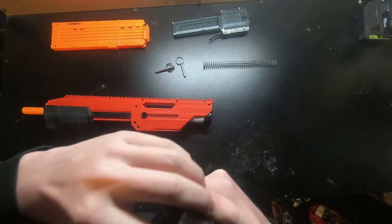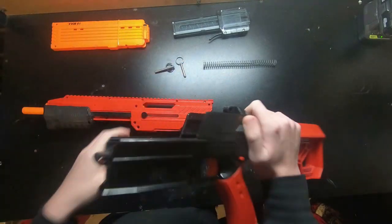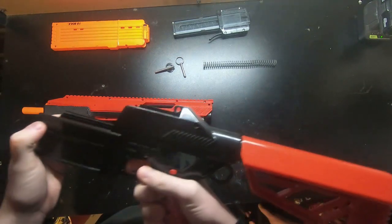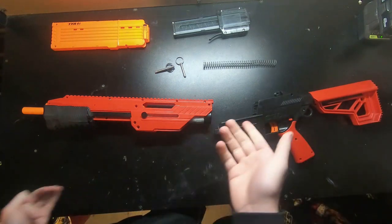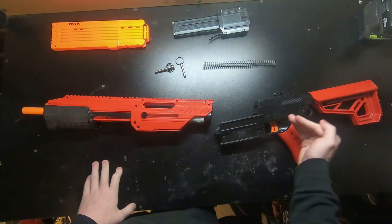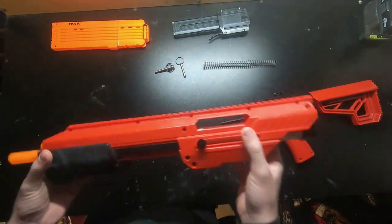The homemade catch is just made of the stock catch with a little metal sheet to create the new catcher in it. The catch spring on the Sita is really strong, so I may want to work on the trigger a little bit because it's a bit of a strong trigger pull. When it fires I could sand it, change the angle of attack on the trigger, or reduce the catch spring.